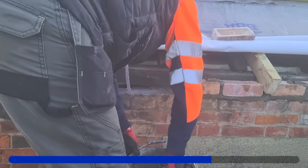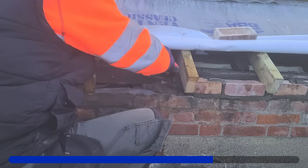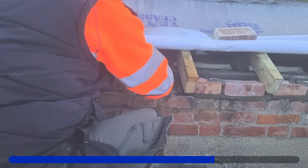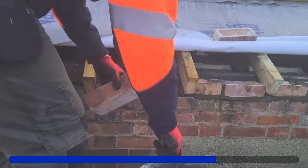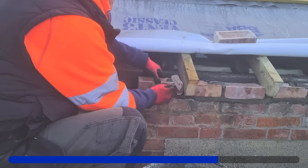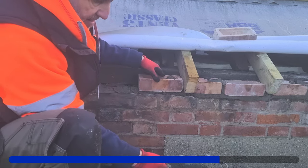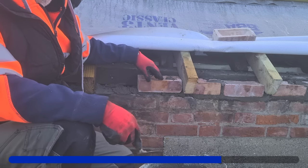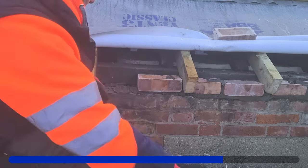Once you've done that, will you give me another bucket of gobber? This isn't going to be a pointy trowel - use a brick trowel. Not too wet - if you just add a bit of water at a time you'll be alright. Remember, sand up to where I've shown you. You're doing it about five to one, so five handfuls of sand then one of cement. If you've got a full bucket, yeah.